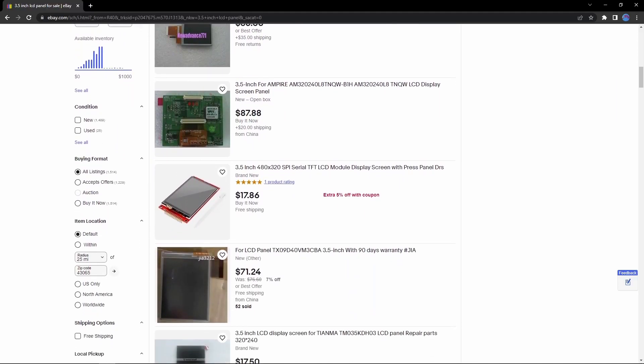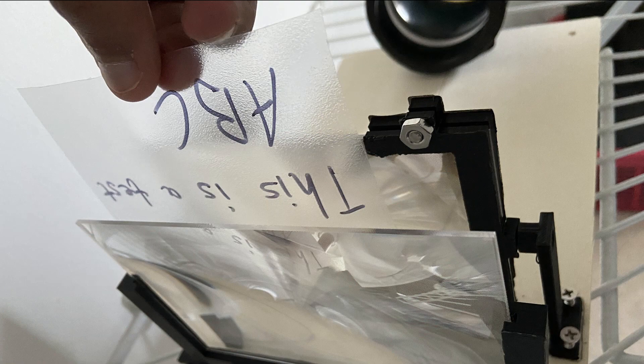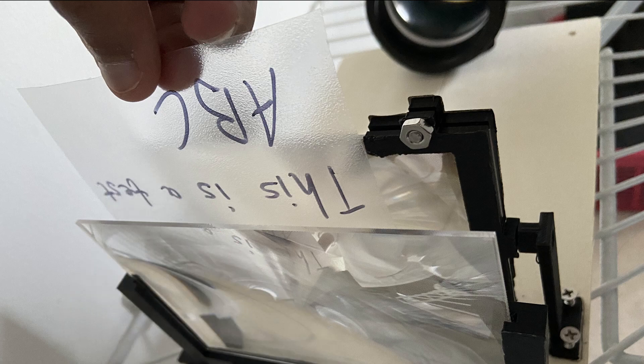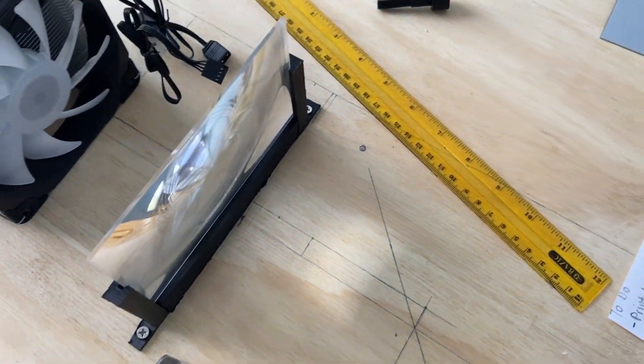With this knowledge in hand, I 3D printed some brackets for temporarily mounting the Fresnel and projection lenses on a small baseboard at the correct distances from each other. Instead of an LED, I used a flashlight where the LED would be. Instead of an LCD, I used some transparent vinyl with text written on it. Keep in mind that the projection lens flips the image horizontally and vertically, and adding a mirror will flip the image horizontally again. With everything more or less tested, we can start mounting our parts to the actual baseboard.